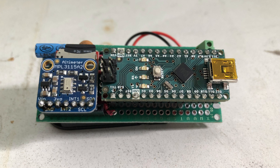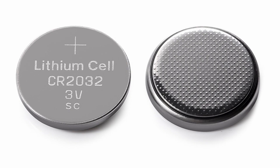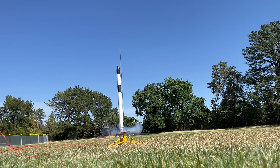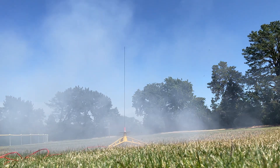We have been slowly developing this altimeter for about a year now. It's made from an Arduino Nano, an Adafruit altimeter, and a SparkFun data logger with a microSD card slot. It's powered by two 2032 coin batteries and logs at around 65 Hz. It was originally planned to fly on Falconry 1, but since that's been discontinued, it'll be used on other rockets that we're developing.